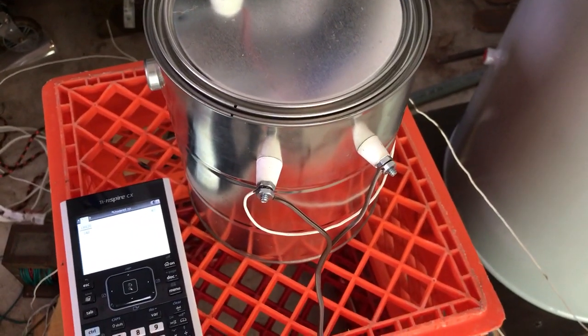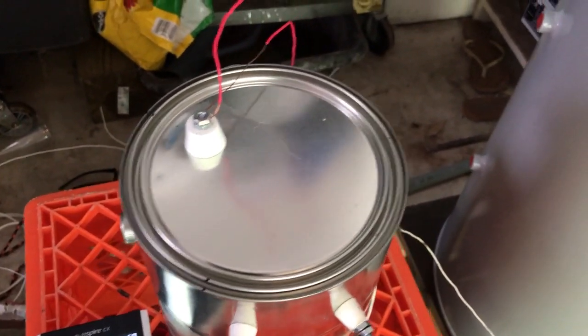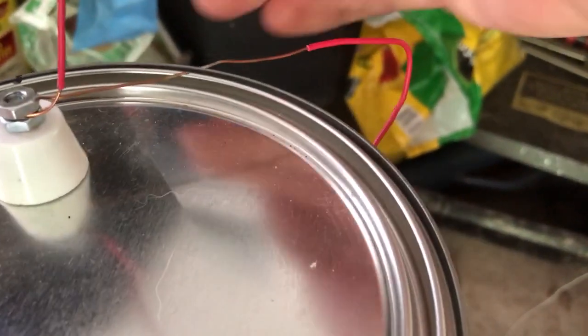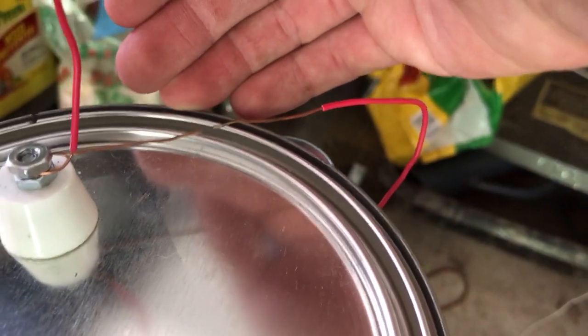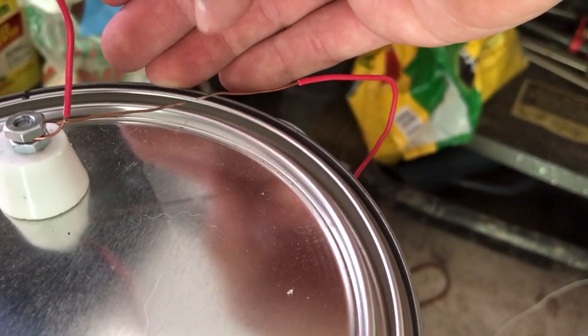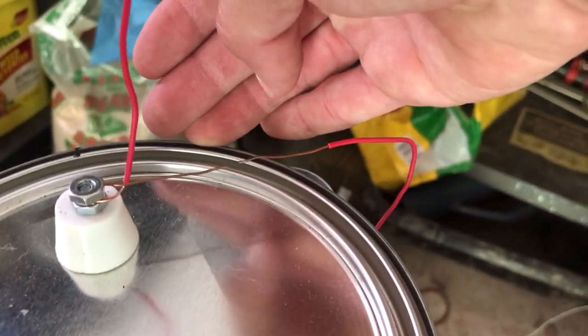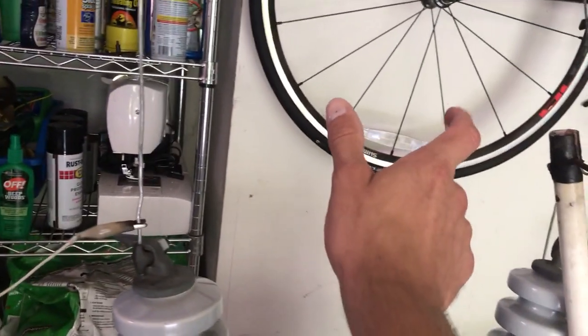There is a microwave oven transformer in there — no fake news going on there. I put on a spark gap which is about good for 2 kV. I already powered it up, and I actually get a surge when I turn the transformer off — a little spark jumps there. That's about a 2 kV spark gap. Now a 20 kV spark gap I put about 2 inches apart.